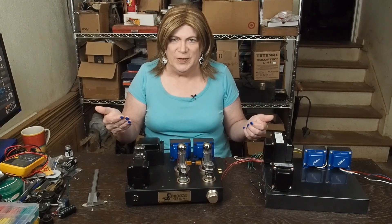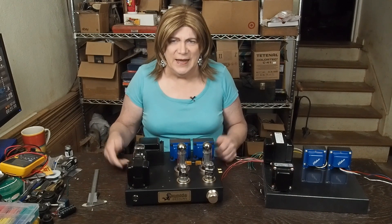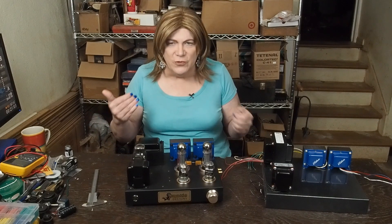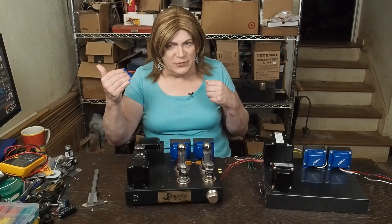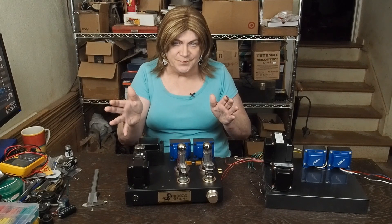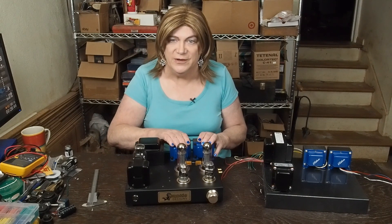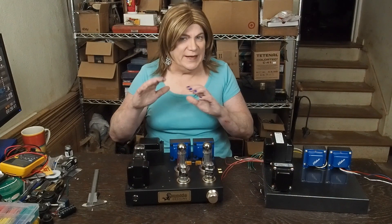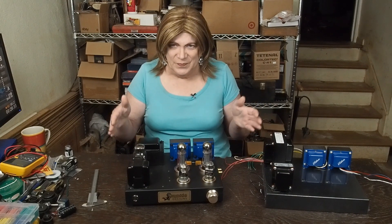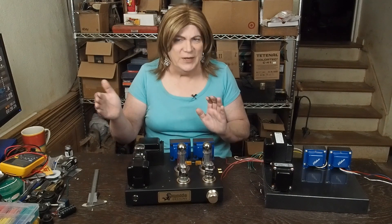If you want to drive EL34s super clean up to max wattage, there are plenty of schematics out there using 12AX7s and more modern driver tubes. But when I saw how linear these 6SQ7s were, I wanted to build an amp with them and I was not disappointed. If you've got efficient speakers and you're going to be in the two to three watt range — with speakers like my Klipsch that go from 40 Hz to 20kHz — please research and know what you need before you decide to build or buy one of these kits.